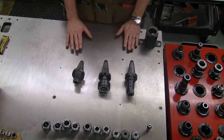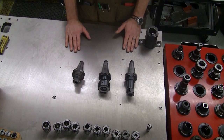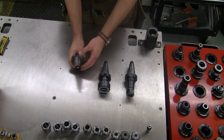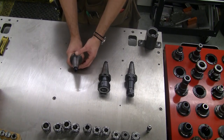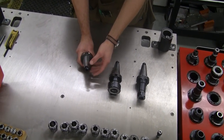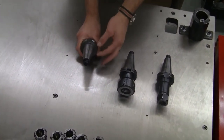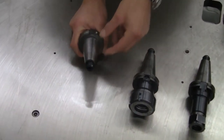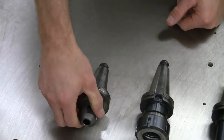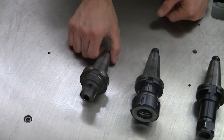All of our CNC machines down here utilize a CAT 40 taper. The CAT 40 taper describes essentially the geometry from the double flange, V-flange right here on up the back of the holder. So this geometry of the taper right here is just known as CAT 40 — C-A-T dash 40 — and that's what our spindles are machined to fit onto.